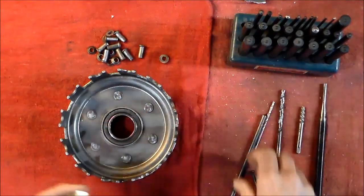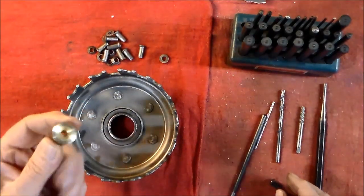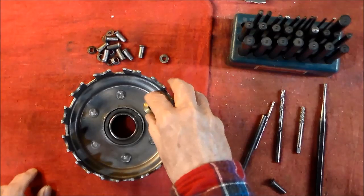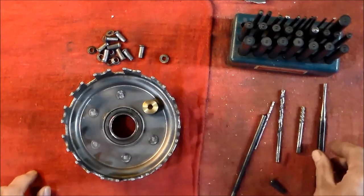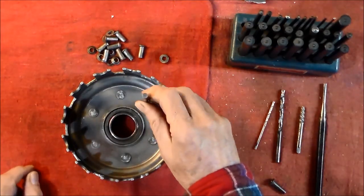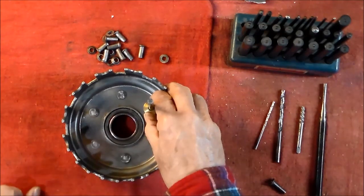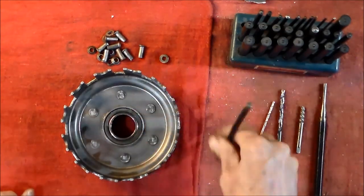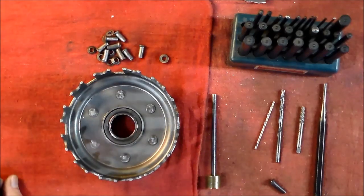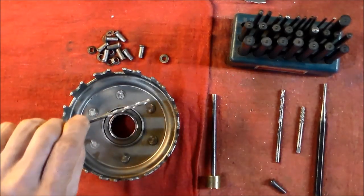See that — this fits in there. All I do is take this and set it over top of one of the rivets. I take the transfer punch, set it in there, make sure it's centered, and hit it with a hammer. That gives you a center punch mark somewhere near the center of all the rivets.